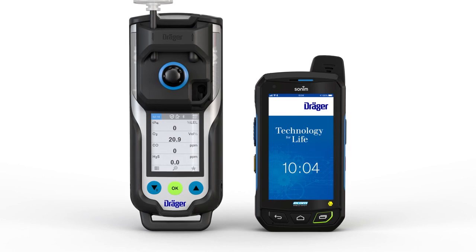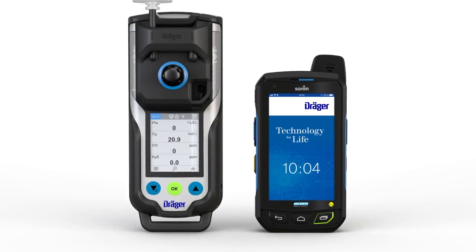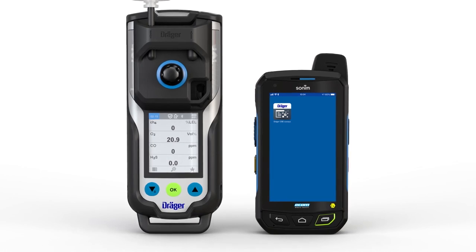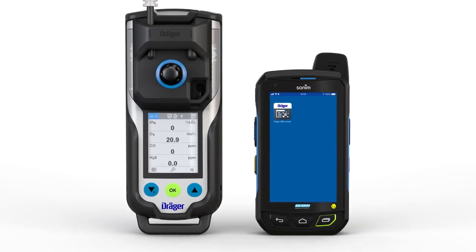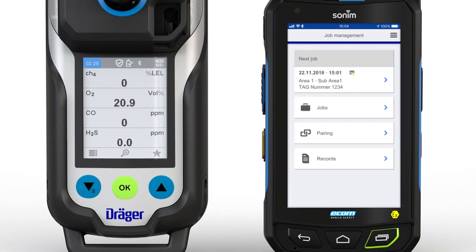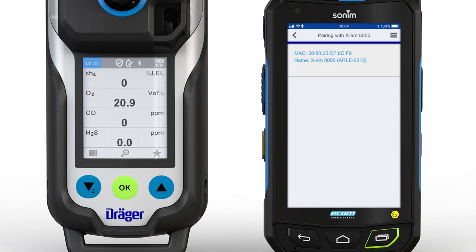The X-am 8000 can be connected to suitable smartphones in order to use the optional Draeger CSE Connect app. To do so, proceed as follows. Bluetooth must be activated in the X-am 8000 and on the smartphone. Open the CSE Connect app and select Connect. Select the X-am 8000 gas detection device.